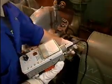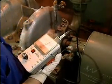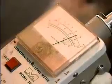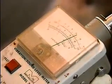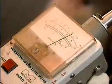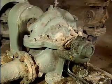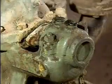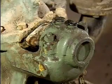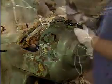Excessive vibration may be a sign of shaft and coupling misalignment, a bent shaft, or some other shaft problem. Other possible causes of excessive vibration include such things as damaged bearings or wearing rings. The sound that accompanies vibration can indicate what the problem is. For example, vibration along with a howling or growling sound could indicate damaged bearings.